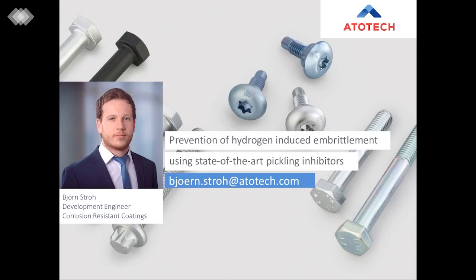The next question, is there extensive foaming when stripping zinc layers? So as I said during the summary, this product is a formulation which is non-wetting. So when the pickling bath with UniClean 511 is in contact with the zinc layers, for sure we have strong gas formation because the zinc layer is dissolved, but there is no extensive foaming. There's a very small, I would say, foam carpet building up, but this really goes away very, very fast.